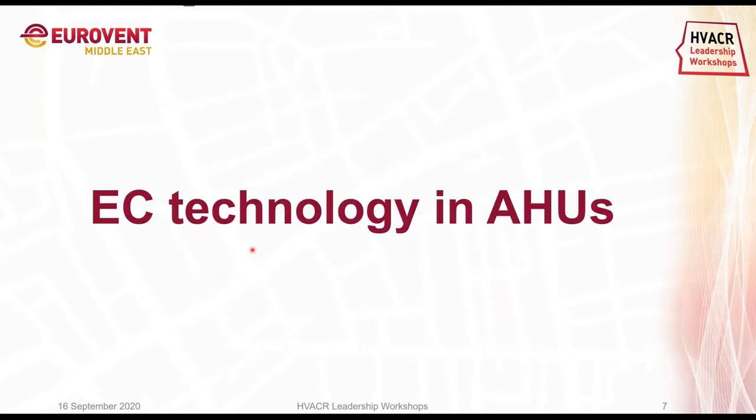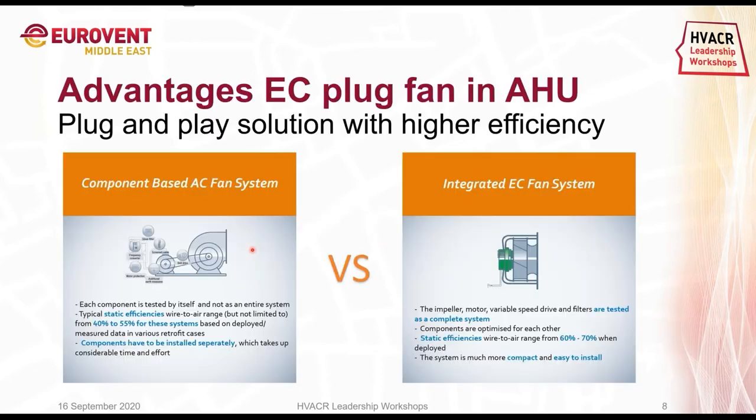Taking the EC technology into the AHUs, we see several advantages compared with the old-fashioned AC belt-driven fans. One of the advantages is the plug-and-play system. On the left side you see the AC belt-driven fan, where each component is tested and mounted separately, and therefore we reach a total static efficiency of 40 to 55%. The issue with this is that you need to install each component separately, which takes a considerable amount of time and effort. And it may also happen that the motor and the impeller are not mounted correctly, so that the belt will run off, for example, or other things can happen.